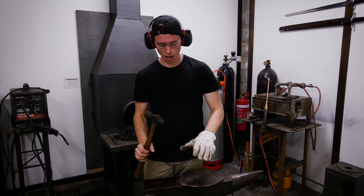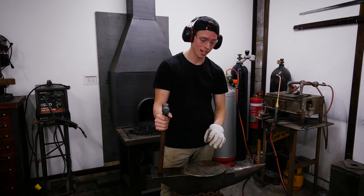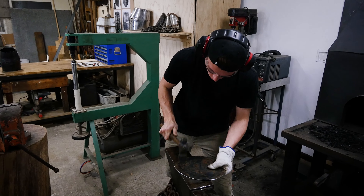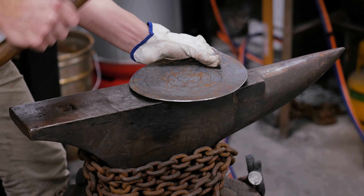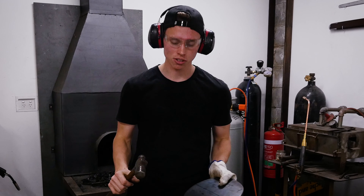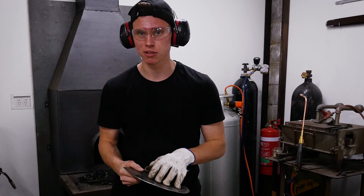The helmet top is cut out. Now we're going to work this entire plate to give it some strength, work hardening and rigidity before we go to turn the edge. This is important because since this is mild steel it's just going to warp and deform and bend, twist and do all kinds of nastiness that we don't want if we don't first put some shape and rigidity into it.